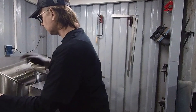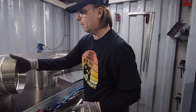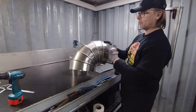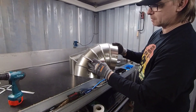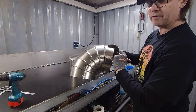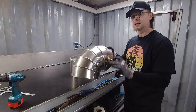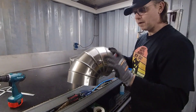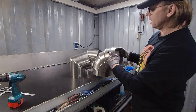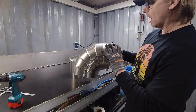Okay, that was a joke. Now, to get the 18 degree segment, we make a normal segment elbow made out of five parts. That means I have four segments, a starter segment, and an end segment — that is a five-part segment. That means when I divide 90 degrees into five, one segment is 18 degrees. So 18 plus 72 makes 90.